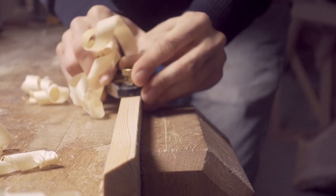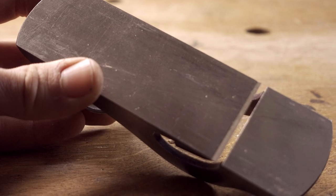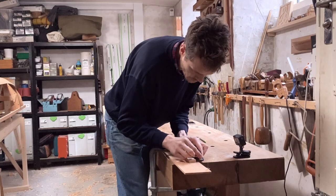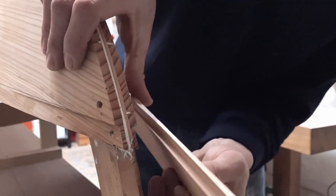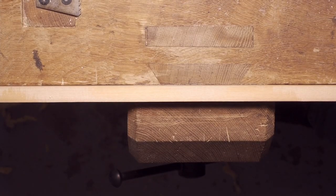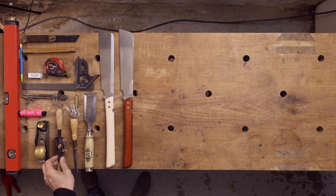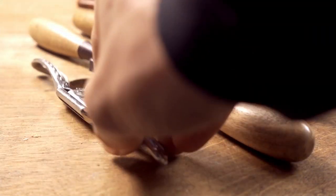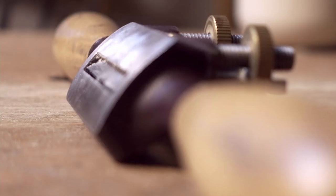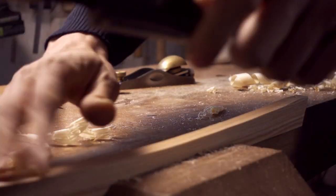If you're on a budget and want to spend extra money on only one high quality hand tool, the block plane would be the one to splurge on. If you're building a lap strake boat, you might consider a so-called rabbet block plane where the blade extends all the way across the width of the sole — this feature is handy when cutting the gains at the end of the planks. A block plane has a fairly long sole, which makes it great for smoothing rough cut surfaces, as the sole ensures the plane can only cut the high spots. But when you're doing concave work, the blade simply can't cut the wood — this is where the spokeshave comes to the rescue. Spokeshaves come in many sizes and shapes, but all you need is one with a rounded sole, as it can take the tight curves found in many hull parts. The spokeshave with a rounded sole can be tricky to use, so you'll need to practice and keep it very sharp.